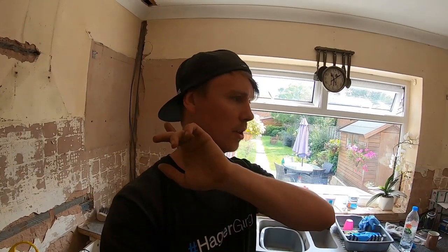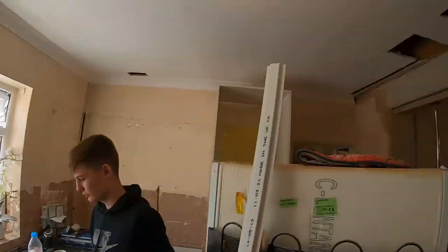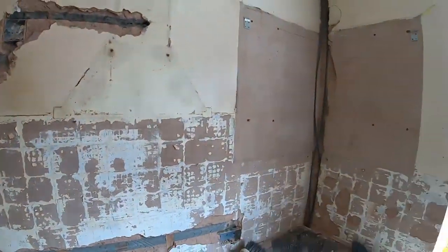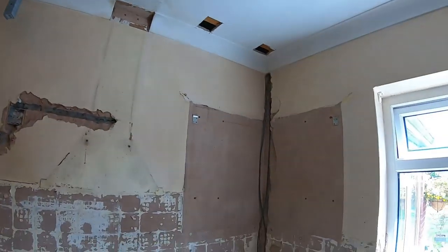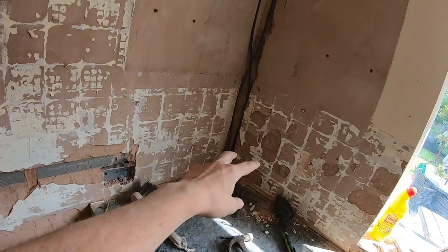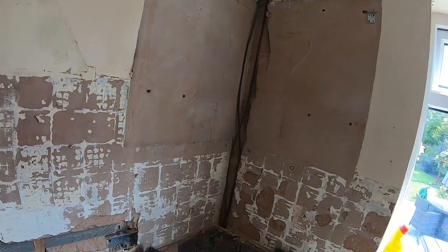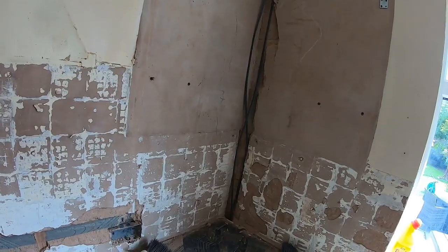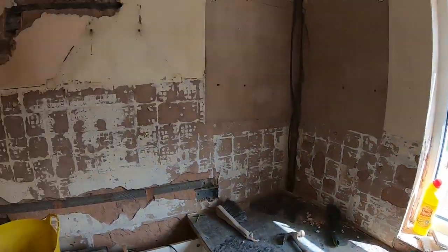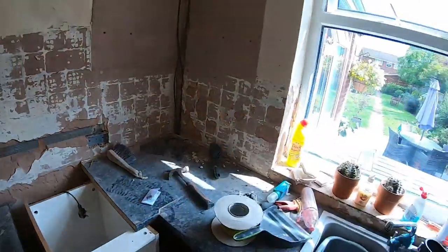I put it back on the board, so the ring main now is going to be utility, conservatory. So we're going to get the level out now, mark out where we want boxes, start making a bit of a mess, put that back up. Obviously I've not done a fixture there, so that's just within regs of 115 from the wall. 115, 150. So that'll be capped later on once this unit comes out. So yeah, laser round. Give that a go.